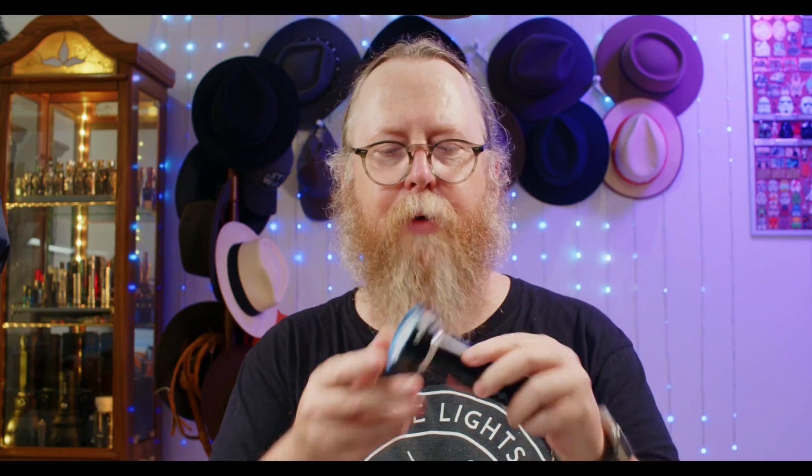Now the ring around the side here is actually a pleasant 3000K, kind of mimicking incandescent light. It's also low CRI, but the tint is bang on — zero all the way across. So really what I want to do is just bust into this light, change out the emitters, and I'll have a perfect light.